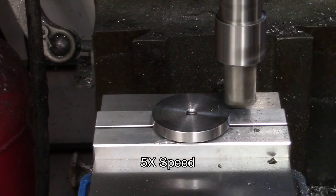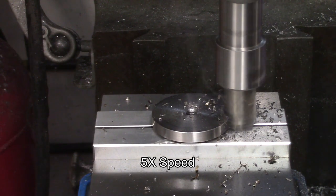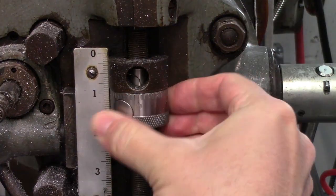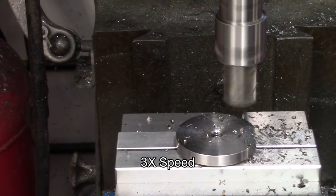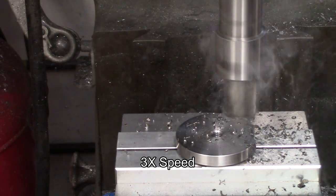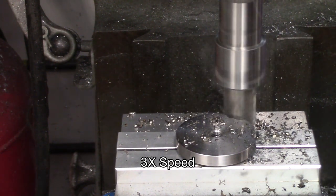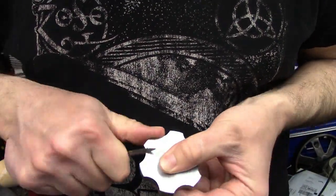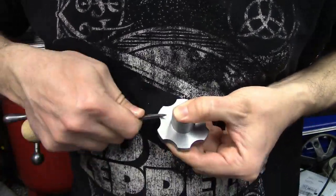Now that I have talked about math for too long and my retention rate has plummeted, let's cut these notches. I'm using the quill to make the cut just like I would with a drill, and I set my quill stop so I don't accidentally plow into my vise when I break through. I used a good amount of oil to help out with the cut, then it's just a matter of going to each coordinate and letting that baby eat. I had a whole lot of deburring to do on each side of those notches, but a triangular scraper made pretty short work of it.